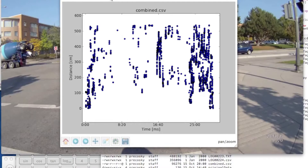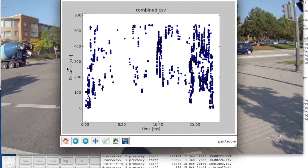So here's a plot of 30 minutes worth of raw data. It actually makes a lot of sense, and I'll go through some sample overtakes here. The vertical axis is distance measured in centimeters as reported by the ultrasonic sensor. On the horizontal axis — I mislabeled it milliseconds — but this is actually minutes and seconds in the helmet camera video at which each of those samples were taken. At the left here is a big cluster of points — that's just when I was moving the bike through the house, yard, and into some narrow residential streets, measuring lots of objects like parked cars and even big trees and bushes. The middle section is going by a construction wall, so you can see a steady stream of echoes the sensor received there. And at the far right, that's more riding through some narrow residential streets, so again lots of objects to pick up.